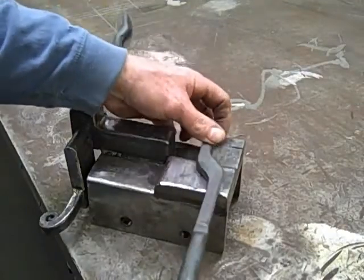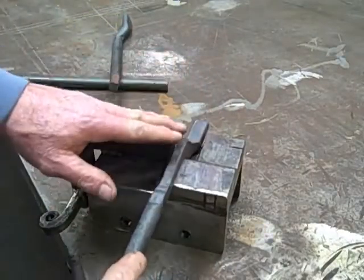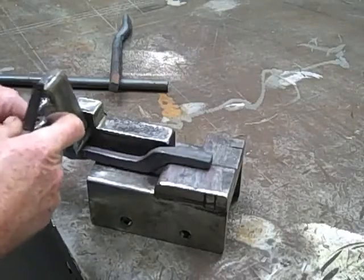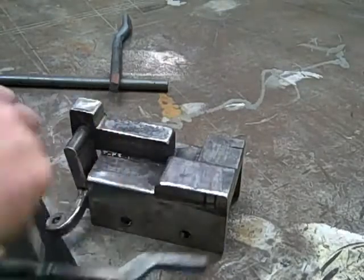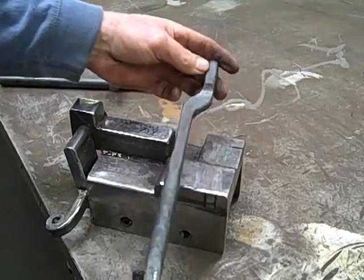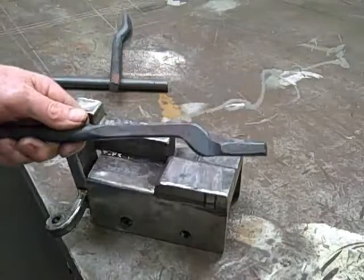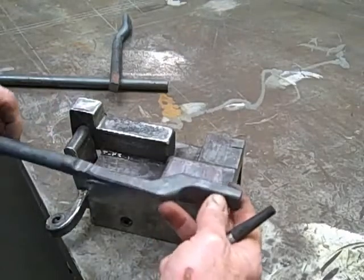The reins can be drawn out to whatever length you want. I'm going to work it this way, come over to this trough a little bit, hammer down here, and work it in this way. Bring it back to this point again, lower the arm, and clean this up, flatten everything out. If there's any heat left after that, we can draw this part of the reins out on this piece of steel right here. The sequence moves pretty quickly, and it's very accurate since all the measurements are marked off on the jig itself. It gives you a nice finished piece.